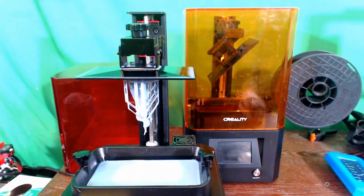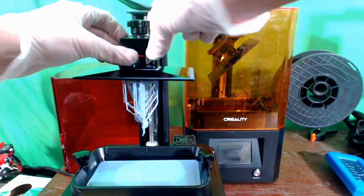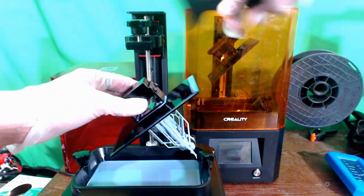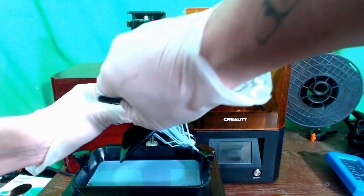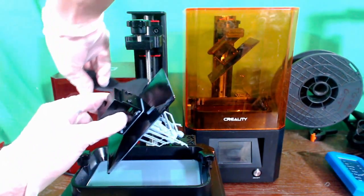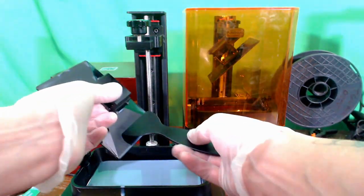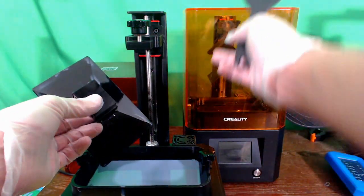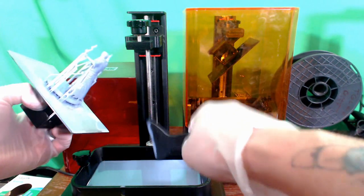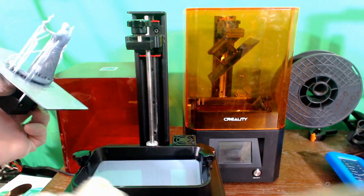I've got my gloves, and the first thing you're going to want to do is loosen this knob here. We're going to try and use the spatula that comes included with the printer. This is a plastic spatula and we're just going to kind of get this excess to drip down. Take a look at the printer to the right there — the LD-002R. That one has a print that I printed: a drip tray that basically mounts right here and leaves it at an angle so it will drip off on its own. And I'm already making a mess here — this is what I mean by this being a little bit of a process.